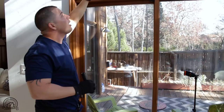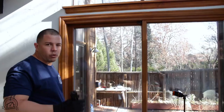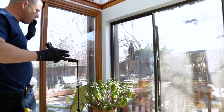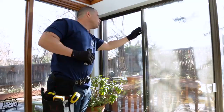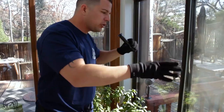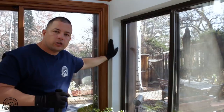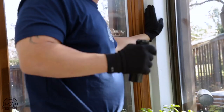We're going to make sure the seals are working all the way across and check the second level windows. If for some reason we cannot access them, always take a note. On this window here I can see that some of the seals are missing — I'm going to put a note on that. I want to make sure we can open the window panel and that it works properly. I like to do a moisture test on the borders here to make sure there's no water intrusion through the window seals. Or if you have an infrared camera, you can use that, whatever suits your needs best.